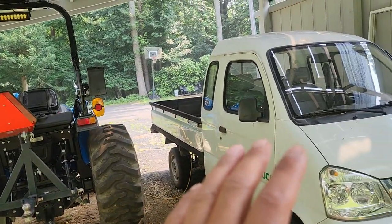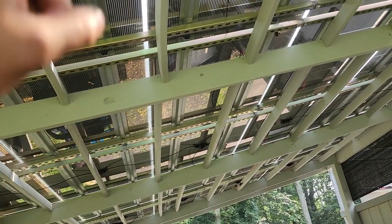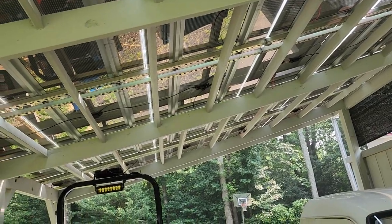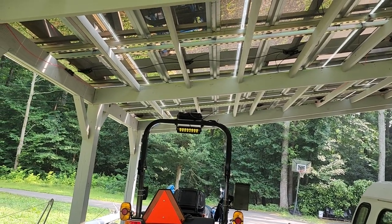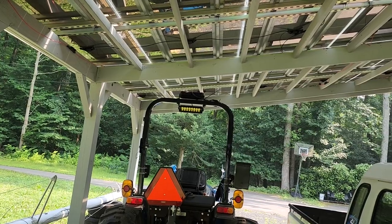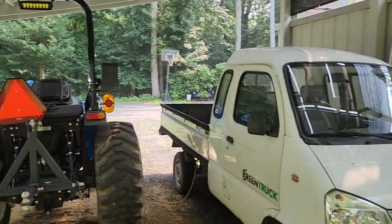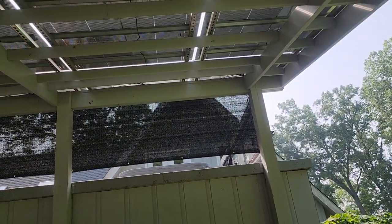I wanted enough space to park two things side by side — typically I had a boat and then the tractor. The only thing I didn't do for this particular structure is put silicone in between the panels; I wasn't thinking that far out yet, so I do get some rain come in. If I had to redo it, they make a T-slot gasket for these — looks like a T, available in half-inch, three-quarter-inch, or one-inch — and you just slide one in between each panel. They also come with glue, so you can seal them out and perfectly seal the whole roof. Overall the system provides great shade and protects the garage from getting beaten up in the morning.